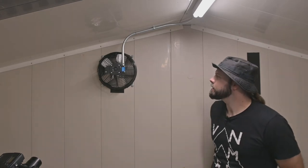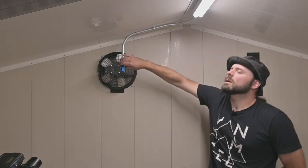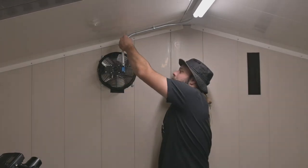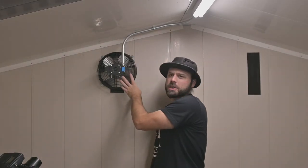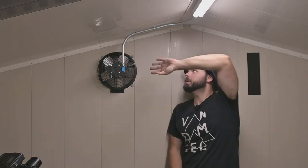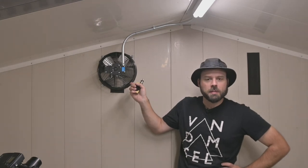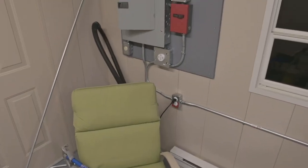I've had ideas of dabbling with maybe a GFCI on here, if I find moisture is coming in. Adding some sort of handy box piggybacked onto this assembly, maybe a speed controller. I think these fan motors can be speed controlled, and they do make what look like dimmers that say fan speed controller on them. So maybe putting that on, because this thing rips, man. Maybe I don't need that much rippage. But at any rate, we can pan around and find that it's all done.